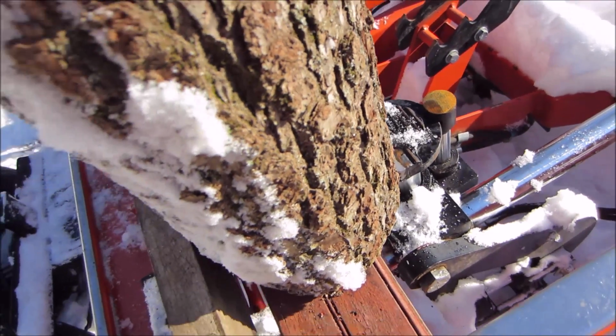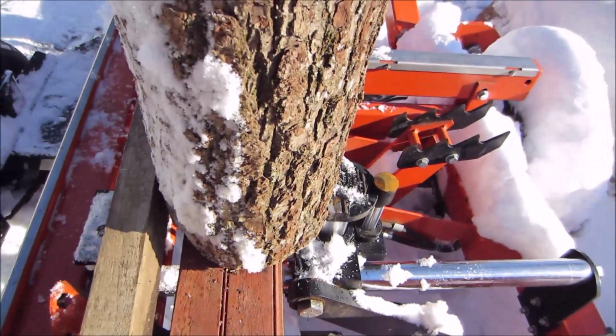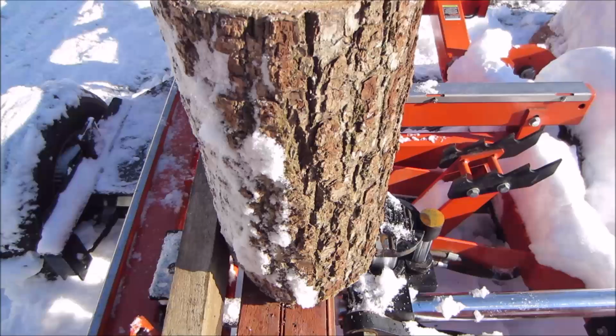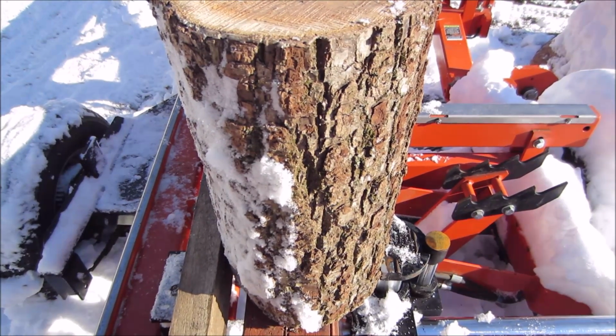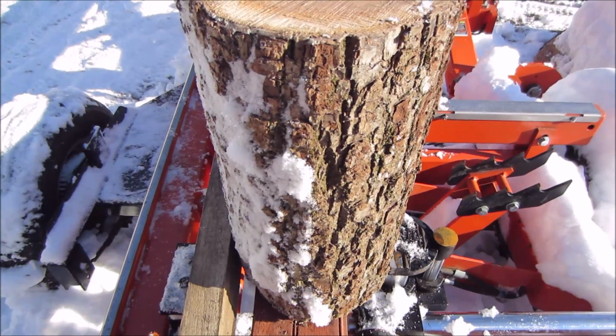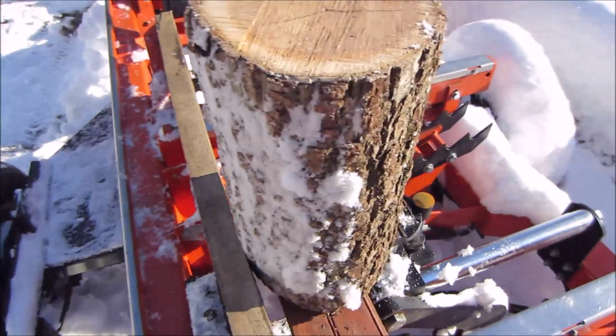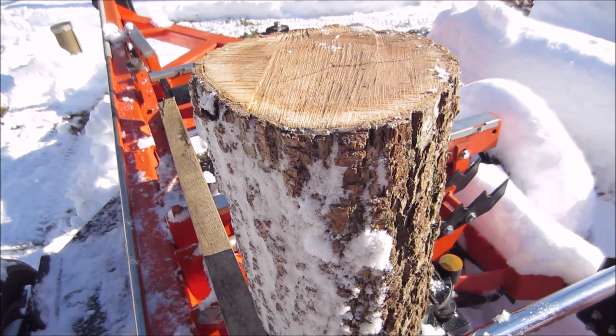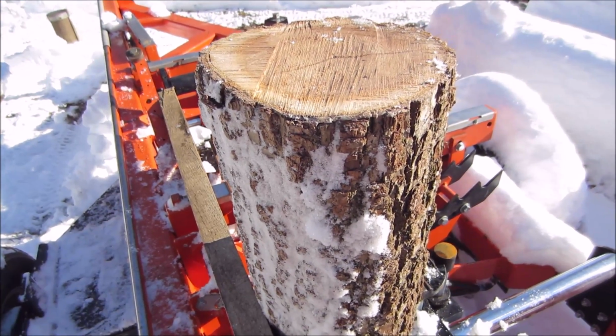Biggest thing is don't have it moving from this direction, right or left, so when the saw blade grabs it, it might throw it out of there. That's still a possibility when you're cutting something this tall with a short stop. So just take your time. Customer wants an inch and an eighth, so I'll give them an inch and an eighth, and 30 pieces. So let's get started.